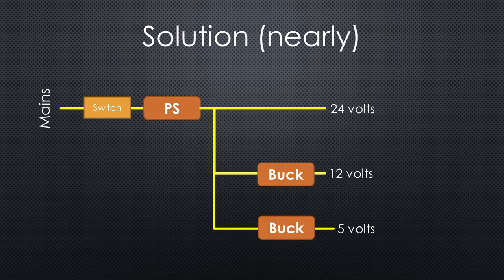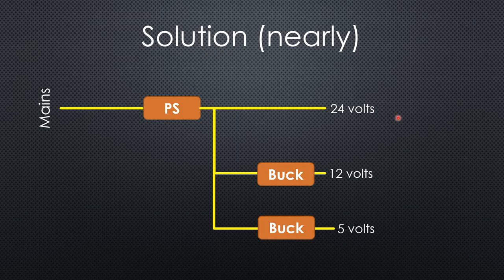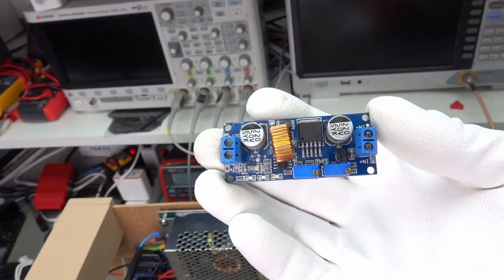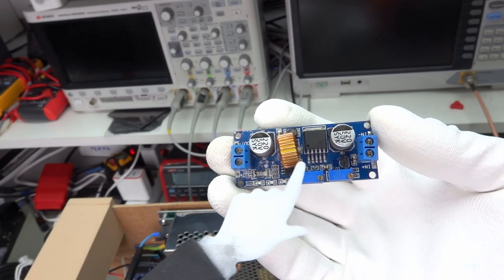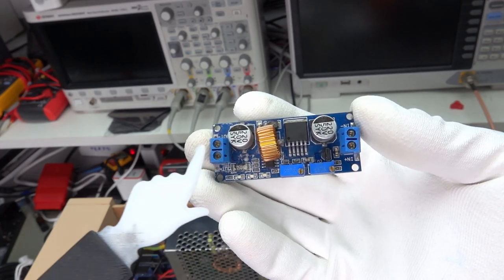Because the difference between 24V and 12V or even 5V is significant, the best solution is to use switching regulators. And because I want to keep the possibility to go up to 27V, they have to support at least 30V input voltage. The current is not a big issue because most switchers support more than 1A output. I selected one from my drawer because it is the only one that supports up to 36V.